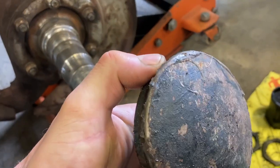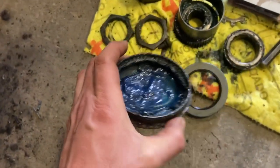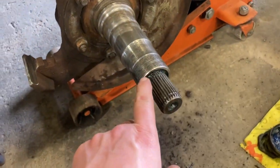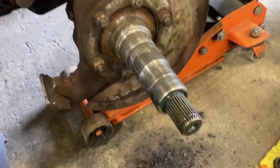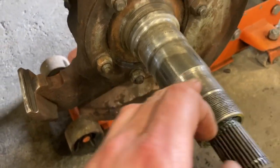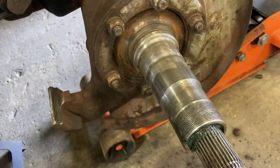The cap that goes on instead of a locking hub — a lot of times you'll see silicone around the cap, just sealing it up. Make sure you cover everything with a coating of grease inside there, because if you don't put silicone in those caps, the hot-cold cycles are going to draw moisture in and it's going to get into your spindle bearing inside here that holds the axle, and also get into your bearing surfaces. On the spindle here you'll start to see rust underneath the bearing. I've never had the outside bearing seize up on this unit — it's just the inside one. Which of course will be remedied with some new spindles and fresh seals.